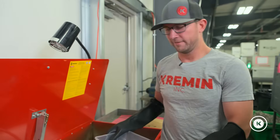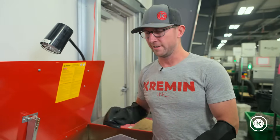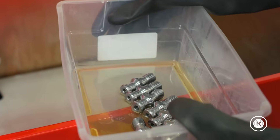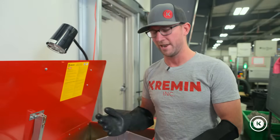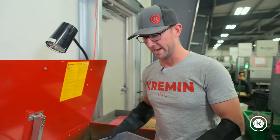Using a solvent washer — not the most difficult thing in the world. The most important thing to remember is it uses mineral spirits to clean dirt, grime, grease, and things that like to cling to parts. Mineral spirits, while not the end of the world if you get them on you, will dry your skin out. Make sure you've got some gloves.